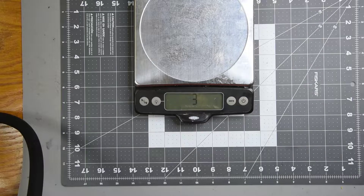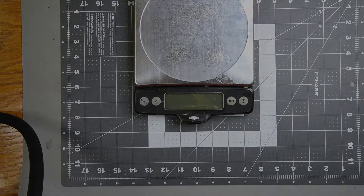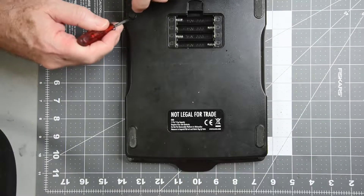That's what it will do until you take the batteries out. Maybe a bad connection, maybe something in the power delivery, or maybe just a switch — even though it feels just fine. But I suspect corrosion will be the most likely problem. I'm sure taking it apart will be fun.